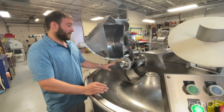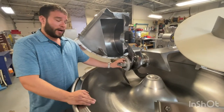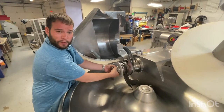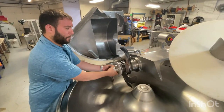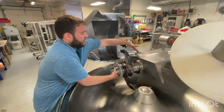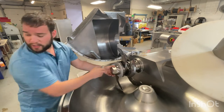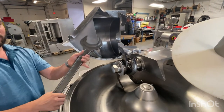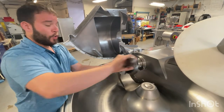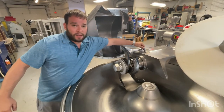When doing anything around the knives, you have to make sure to be very, very careful — these are extremely sharp. Right now the one thing you'll see is that the knives turn freely. They're connected to the pulley so they're hard to turn, but they do turn freely. On the far side here you're going to see that there's a lever. As these knives turn, you'll see it's going to find its way into a locked position. This is when you can use the wrench, which we've provided, to tighten and loosen accordingly. Once done, you need to make sure to slide this back out of the way.